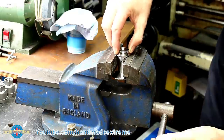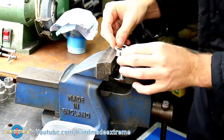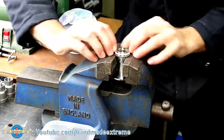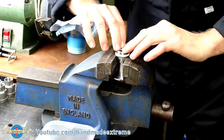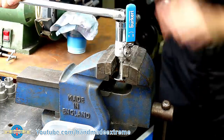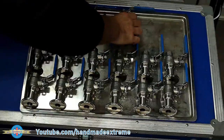The manual valves are really easy to put back together. I simply hold the welded piece in the vise, slip the outer seal over the threads being careful to make sure that it doesn't get damaged and it's the right way up. Then I can put in the inner seal, or the ball seal, again making sure it's the right way up, and then put the valve on and quickly nip it up with a breaker bar with a socket on the end. And that's those ready for pressure testing.